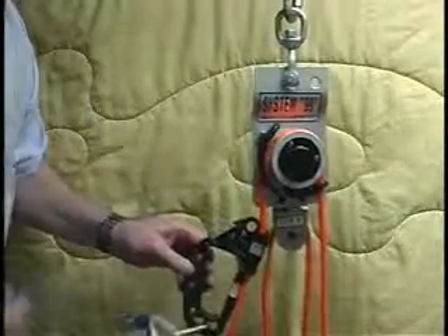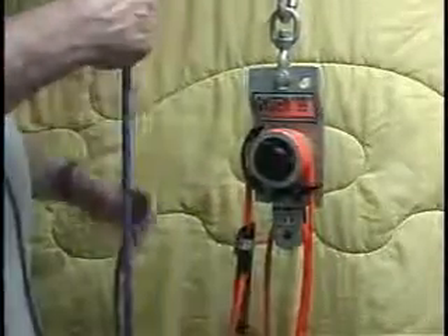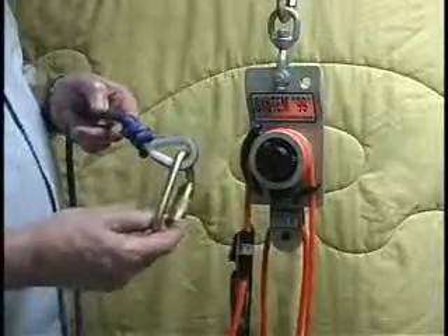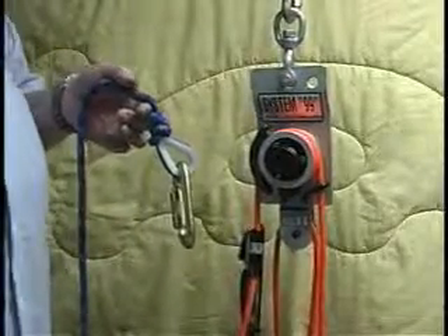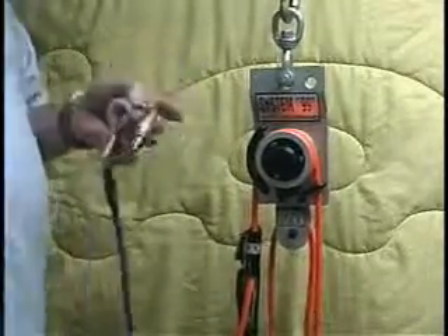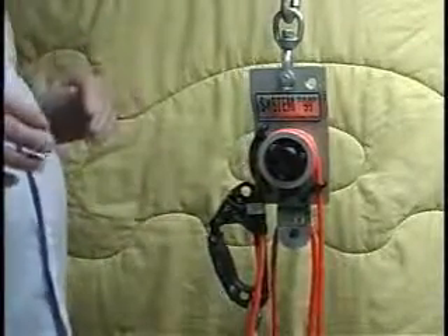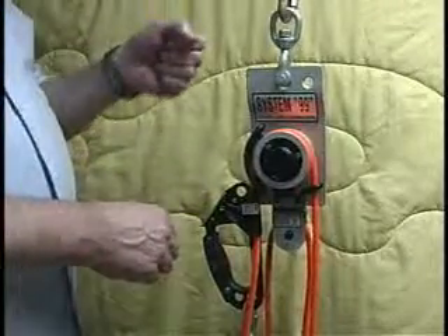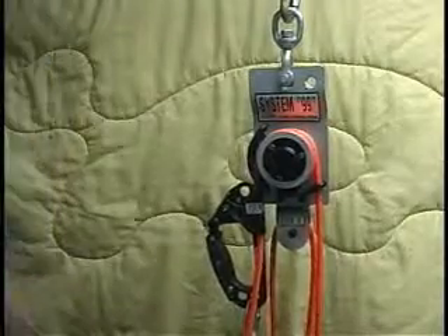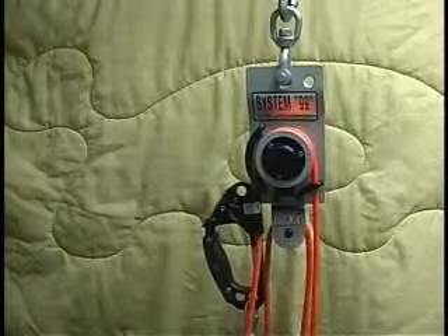On the other end of the handle, you have a screw link and a four-foot handle. At the end of the rope, you've got an eye which we tie and seal in, and a carabiner — this is the side operator carabiner for the outside operator, and it would attach to the bosun's chair. As a self-operator, the other way to work is to tie the handle off by pushing it all the way up towards the head — then you have both hands free to work.